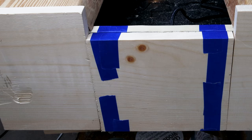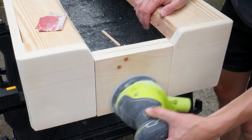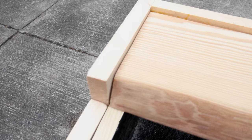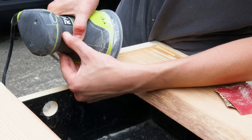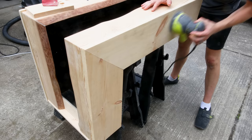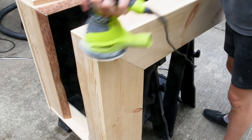Now I can finally finish the exterior. I secured the door from the inside with screws to consistently sand it with the other surfaces. There were gaps along the edges as well — rather than use wood filler, I filled them with wood glue. The glue binds with the wood dust as I sand, creating a seamless appearance. As I did this, I also accounted for the opening on the back and removed the corners to align them with the live edges. Even though I hate sanding, I took the extra time to create a smooth and uniform surface.